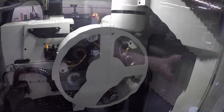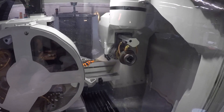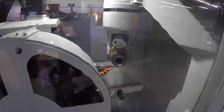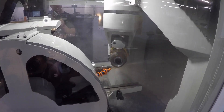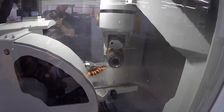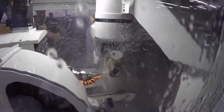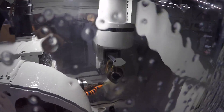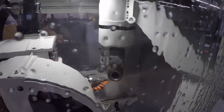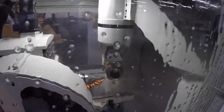Because it's a corner radius tool it's going to do an actual helical radius, but I only did a 15-thou radius so it won't be that obvious. We talk about this on our videos — buy corner-radiused end mills, even a three-thou radius. You're getting rid of the weakest point of the tool. You could even put a two-thou chamfer — a hard chamfer — which is cheaper and easier.